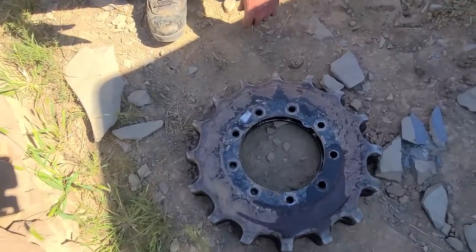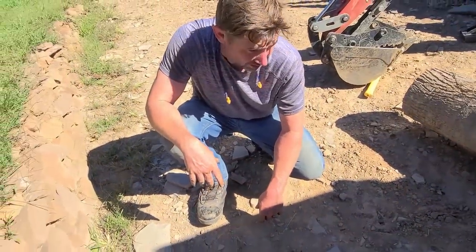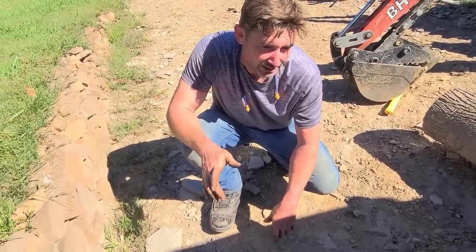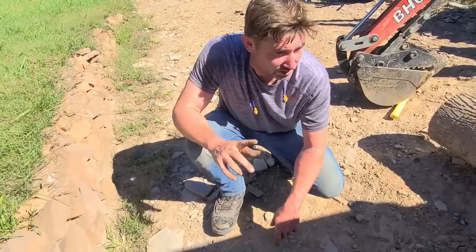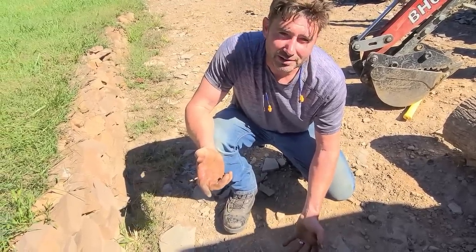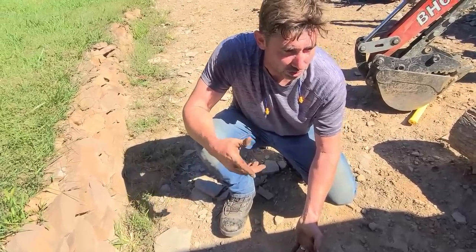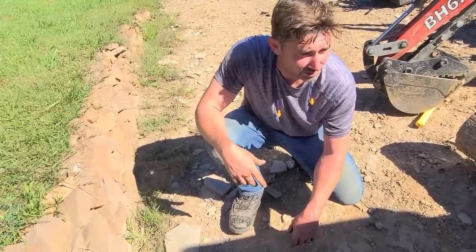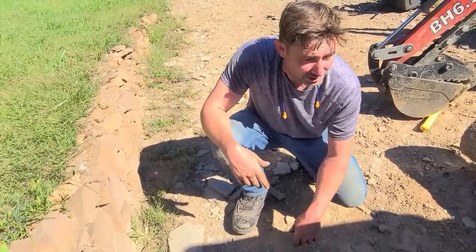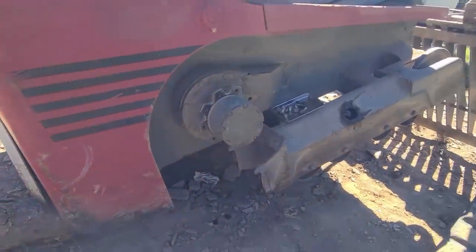Overdue, I think. And maybe another tip: if you're really serious about buying a skid steer or a heavy piece of equipment, and you have your mind set on one particular model, like the Takeuchi TL130, research replacement parts for common wear and tear things, like the sprockets, the undercarriage parts, the bottom rollers, rear idler, front idler, the hydraulics, so that you know what you're getting into. Pretty much. I mean, tracks are pretty standard, like $1,200 each.